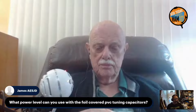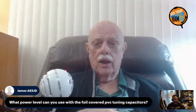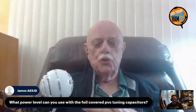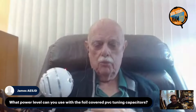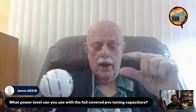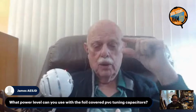Cool. James, AE5JD asks, what power level can you use with the foil covered PVC tuning capacitors? Well, let me again emphasize the fact. I use a Socratic teaching method here, which is to answer a question with a question. Would you think that a piece of 3/8 inch aluminum tubing would handle power? Well, I think most of you would think you could probably build yourself a nice big kilowatt amplifier with a piece of 3/8 inch aluminum tubing. A 1 inch wide piece of 1.5 mil, that's 1.5 thousandths inch thick, aluminum tape will handle the same amount of power.